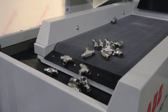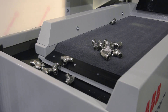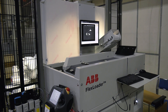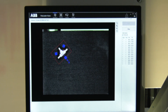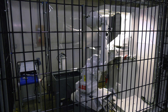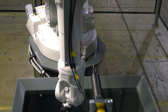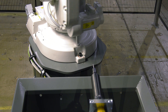Simplicity and flexibility. We take the tote bin, pour the products into the back of the system — there's a little hopper in the system. The belt moves forward, a few vibratory feeders separate out the components onto the final belt, which we can see there. There's a camera mounted above. The belt recognises the parts, directs the robot to pick up the parts very accurately, and then places the part against a deburr tool, which you can hear in the background.